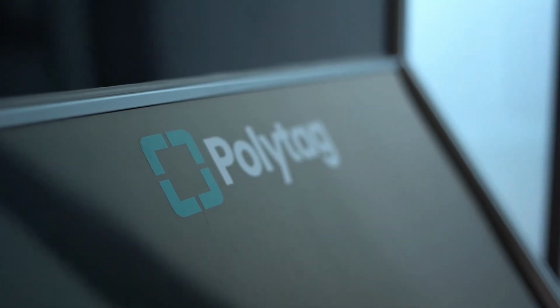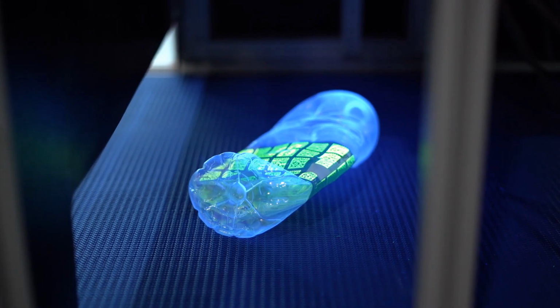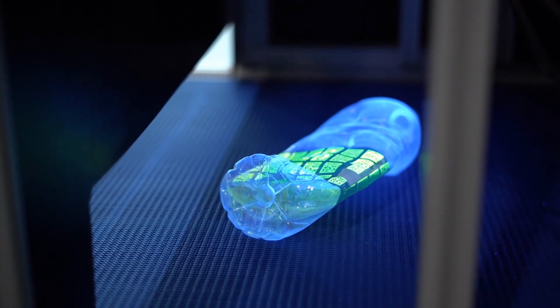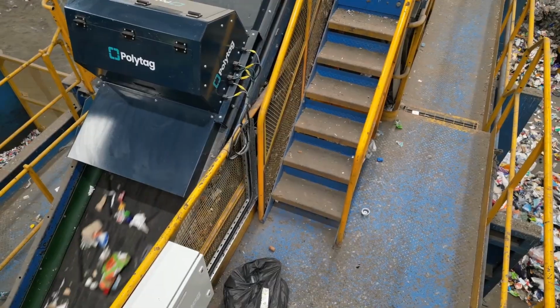When plastic packaging gets to a recycling centre, the UV ink tags are identified by this piece of equipment. The equipment is lightweight, easy to install on a plastic conveyor belt and low cost. The specification for the unit is publicly available and open source. Any recycling centre handling plastic packaging can build and deploy a unit. These UV ink tags can also be detected by optical sorters and separated at high speeds to achieve higher quality food and non-food grade plastic.